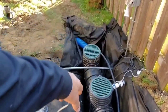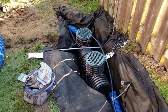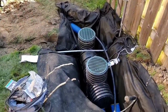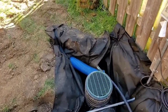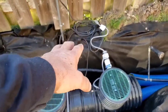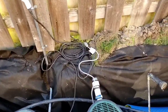This thing is just ridiculous. The homeowner can just take that lid off and drop a sump pump in - say in 30 years if this sump pump quit. Otherwise just the single screaming demon would have been fine. We do have a heater in here, so we've got two cords coming out: the sump and the heater. All our sumps come with a 25-foot cord - that's standard for yard drains.